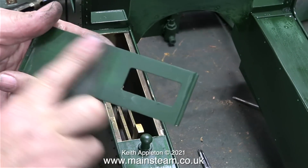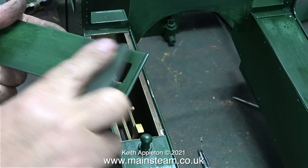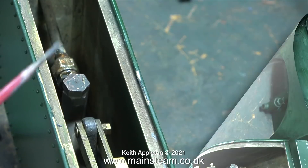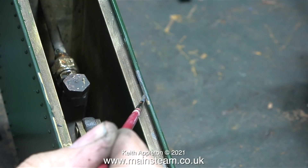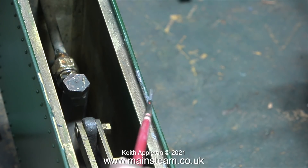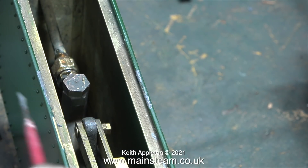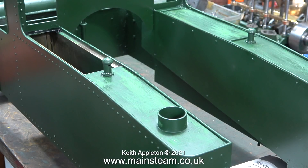The top of the tanks is going to be painted black. Here I'm rubbing down the cover, which was quite a tight fit in the top of the tank, and when I removed it I chipped the paint, so this needs to be repaired. First of all I'm touching in the damage with some etching primer — this is called high build etching primer, so it's a bit thicker than normal and ideal for this job. The thickness of the paint fills the gaps in between the green paint. Before touching in the edges with green paint I left a 24-hour period for the etching primer to dry, even though there was only a small amount of it. I've found that enamel spray paints do not like etching primer until it's really dry.